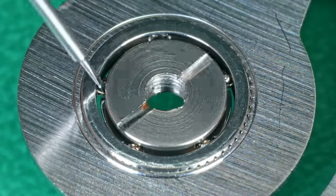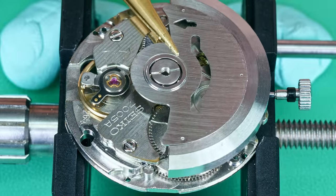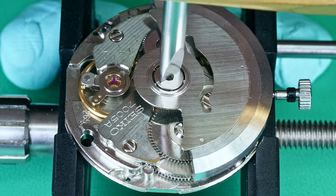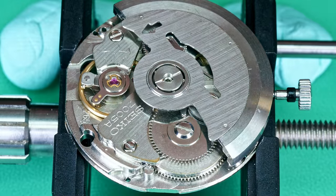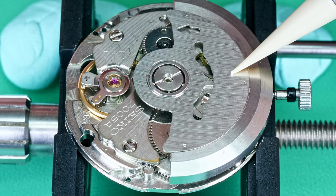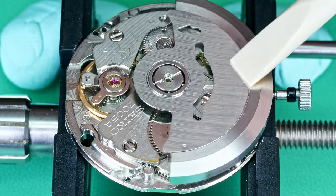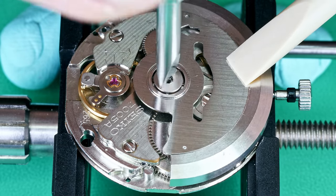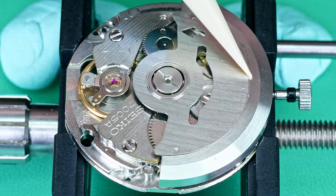You've got some rust there, Leo. I know — I didn't see it. I need new glasses, though that's not really an excuse — I should be inspecting parts. I spend all my money on watch tools; escapement analyzer or glasses — the analyzer, obviously. On the underside of the rotor there's a gear that makes contact with the reduction wheel, so whenever you move your wrist the rotor moves, it moves the reduction wheel, and you've seen the chain reaction of how it winds the mainspring. You have to align the hole in the reduction wheel with the hole in the balance arm and the middle of the rotor with the stem. All the Seiko manuals I've seen tell you to do it like this — so let me tighten it and let's have a look. Let's rotate it — there we go, that's what it needs to be.